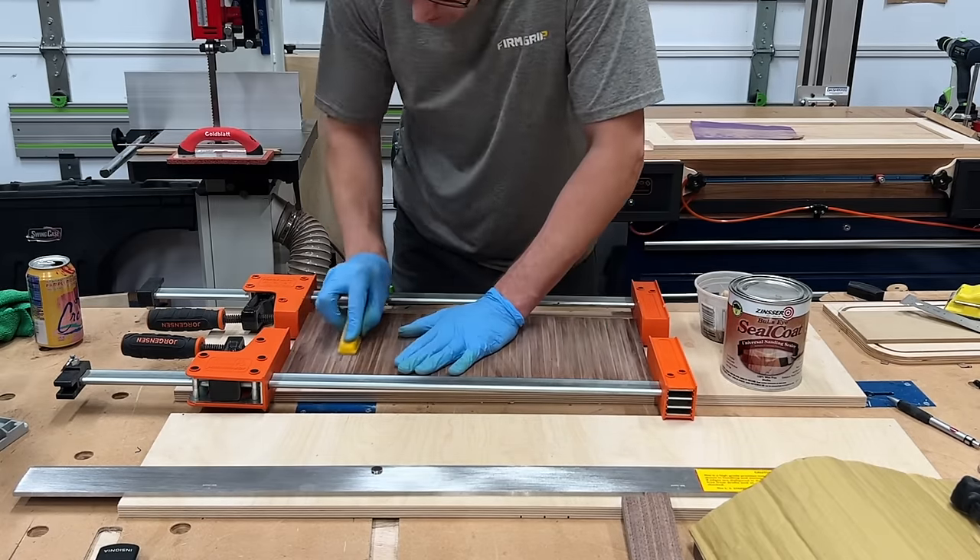I screwed up big time, but I didn't realize it until I had cut a few of the hexagons. I accidentally aligned it up with the bottom of the tape — it should have been in between those two pieces of tape. After a childlike tantrum, I decided to just push on and come back and fix that later. I adjusted my design to the correct position and started cutting all the hexagons. I had a one-eighth inch bit to remove the majority of the material, then came back with a sixteenth-inch bit to get the corners as square as possible. Much more square and crisp — it's a round bit so you can't get perfect, but pretty darn close with the sixteenth. Then I came back with a hand sander to get rid of all the fuzz. I had some hexagons carved out completely and some that were just outlines — big ones, medium ones, and smaller ones too.